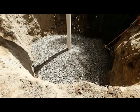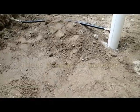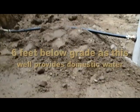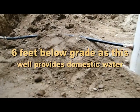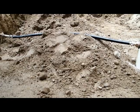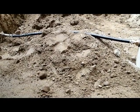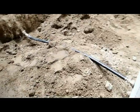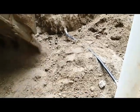The offset to the house has been installed with a bit of a crown, so that if and when the soil settles — which usually happens — it will not tend to pull it down or away, or tip the pitless adapter so that it's difficult to get the pitless tool onto it.